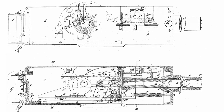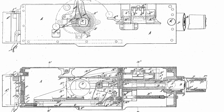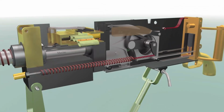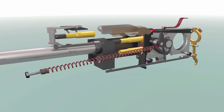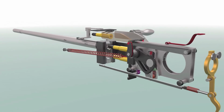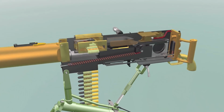The big focus? Self-contained sub-assemblies, part groups that can be swapped out as a whole. It also embodied a number of simplifications to the operation of the gun itself, bringing the parts count way down. And really, it is 90% of the gun I have today. Belt fed from over the top, it was the first design to use the now iconic multifunction extractor. This vertical slide action would rise to pick up the next cartridge on the belt, fall to align it to the chamber, rise again while the chamber held the live cartridge in place, and it picked up that next cartridge up top, and then after firing, fell again to shunt the spent casing out of the action. This design also sports the coil spring powered fusee that we'll recognize in a moment.